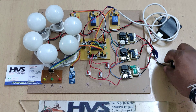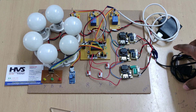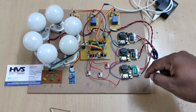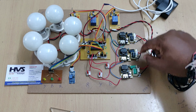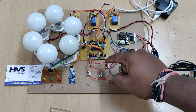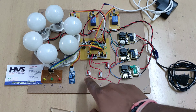For phase checking, three current sensing circuits are used to check phase availability. For demonstration purposes, we are converting single-phase 230 volts to simulate three phases. Phase-to-phase voltage is 440 volts, but phase-to-ground is 220 volts. We are providing 220 volts to each of the three current sensing circuits. The output of the current sensing circuits is fed as input to the PIC 16F72 microcontroller at the A0, A1, and A2 pins. Switches are placed to simulate faults.